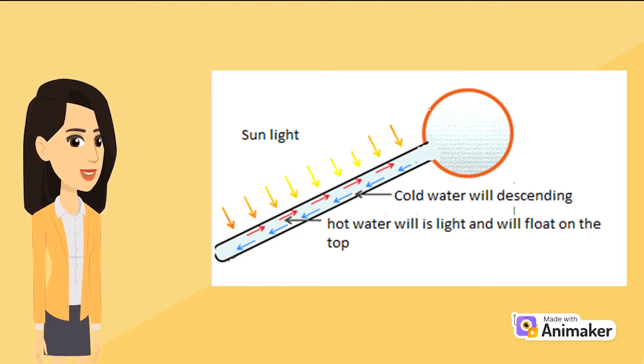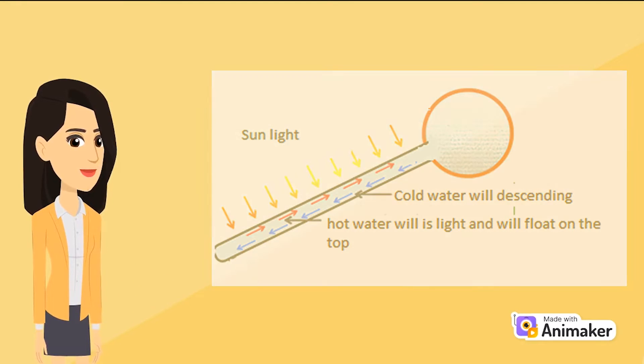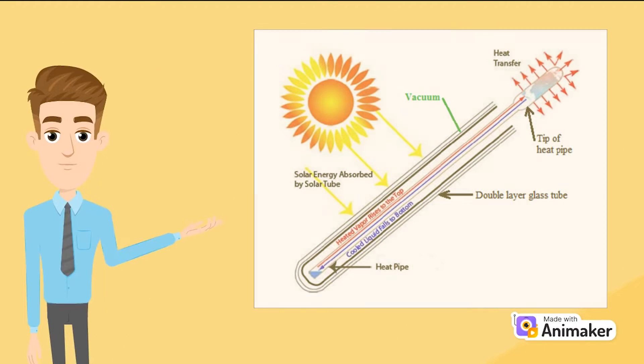As this cycle is repeated, water stored in the solar water heater gets heated. The high pressure version utilizes the indirect method, where the vacuum tubes heat up the heat pipe which in turn transfers heat to the inner tank. The selective coating on the inner cover of the evacuated tube converts solar energy into heat energy and transfers heat to the heat pipe by aluminium fins.